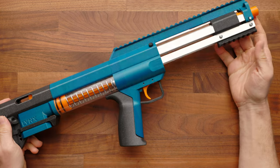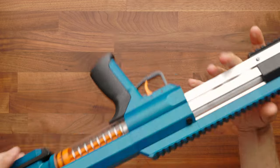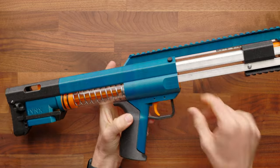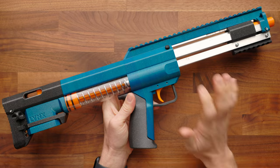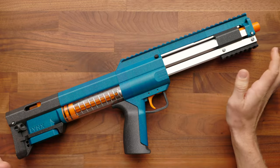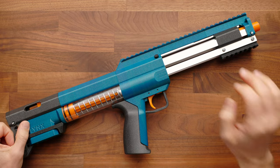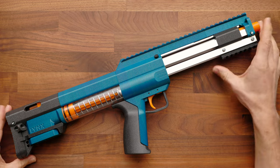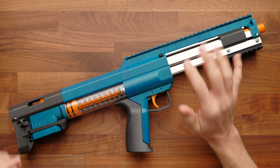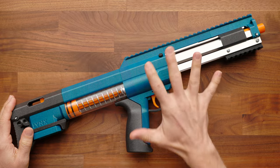Number one: storing and caring for your blaster. If you are printing in PLA like we are — because we think it's a great plastic — you do not want to leave this in a hot car. The material is very durable and we have shipped tens of thousands of parts, and it is extremely rare to see a warped part. However, on a hot summer day in California, Texas, Hawaii, or really anywhere in the south, if you leave this in your car where it can get 150-160 degrees Fahrenheit, you could experience warping. So don't leave your blaster in a hot car.